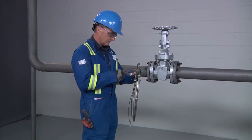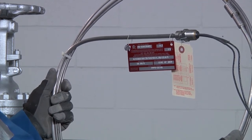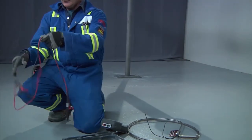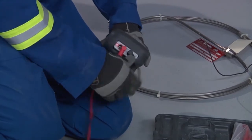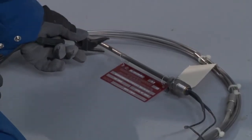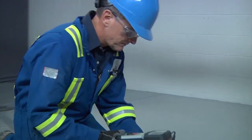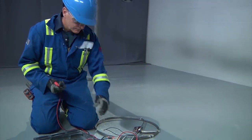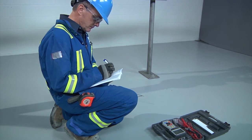XMI heating units are individually designed for each section of pipe, and it is critical that you ensure the correct heating unit is installed on the specific section of pipe it was designed for. Conduct an insulation resistance test while the cable is still coiled and in as-received condition out of the box. Measure the insulation resistance between the conductors and the cable sheath by connecting one megometer lead to the conductors and the other lead to the cable sheath. The insulation resistance test should be conducted using a test voltage of 1,000 volts DC; however, in the absence of such equipment, a 500 volts DC test is suitable to detect most installation-related concerns. Insulation resistance should be 100 megohms minimum. Record the megometer reading in the installation and maintenance manual.